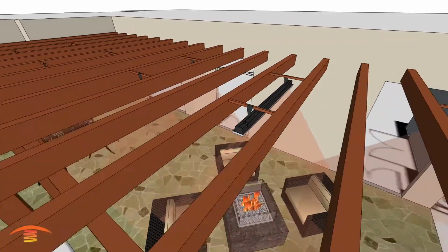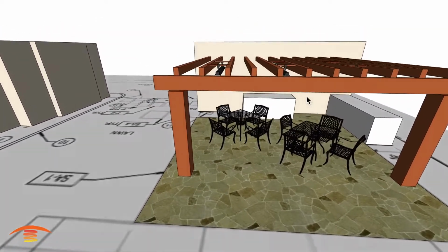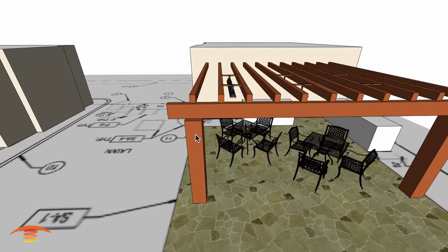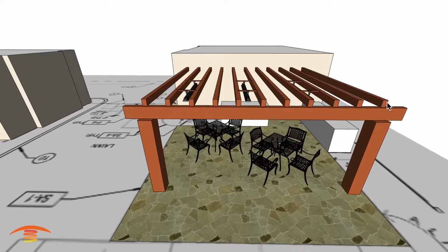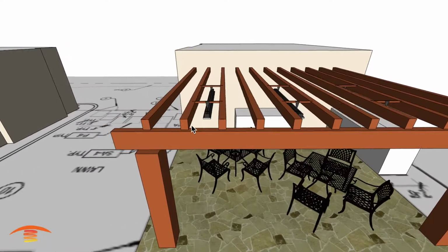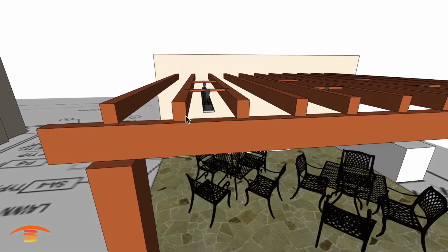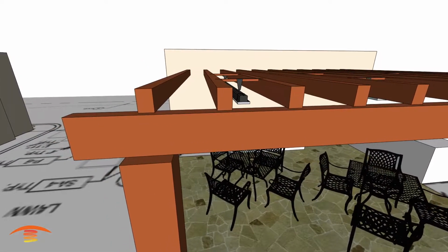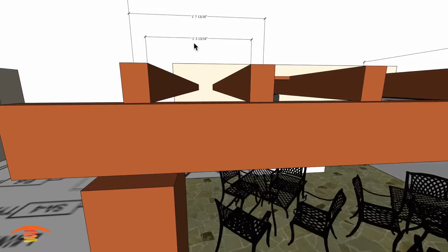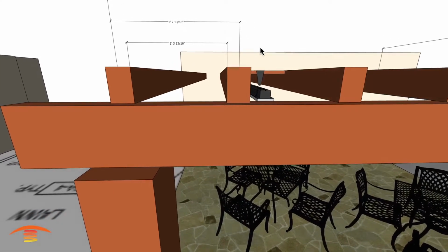All right, so let's go ahead and look over here on this side. I think we already went through the dimensions itself. One issue I saw here is that the beams started at the center point of the post, and that is fine. I'm assuming they're evenly spaced between this whole span, and when you put a 4x8 dimension there, the clearance or the span I have opening is 1 3 13/16, which I am off 7/8 of an inch.